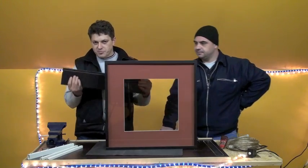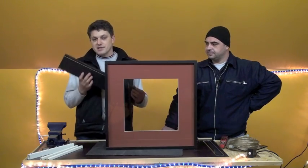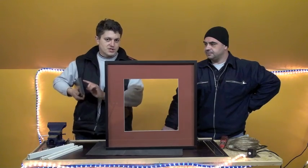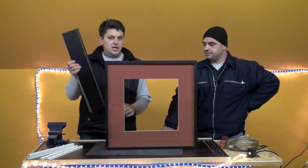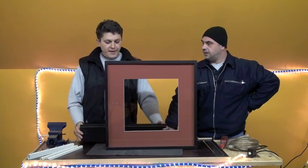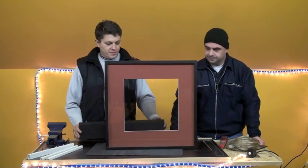We did this for the glass so we wouldn't have to struggle figuring out how to secure the glass - this is the simplest way. The people who cut the boards where you order can do this for you. We also asked them to bevel all sides, precisely so we can control the glass - so it doesn't slip out. You don't need to bevel much so it's not expensive, and have them do it on all sides right away. The excess is easy to remove with a scalpel, so it's no problem.